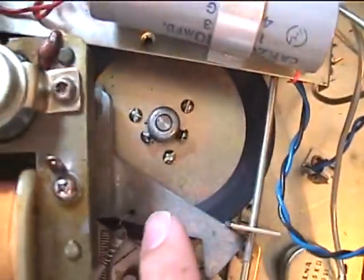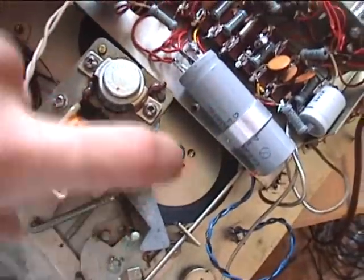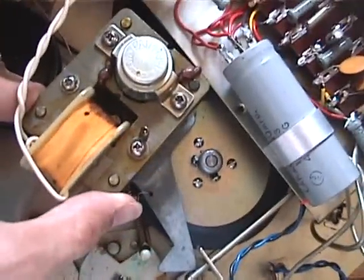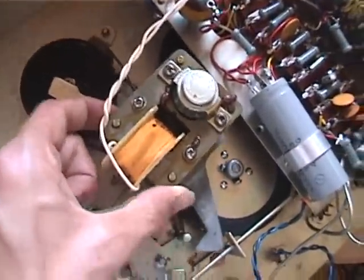Of course it's not turned on. If you notice, on the same motor assembly, the other side, there's a little part that goes out to a brake. So when you put it in play, it releases a brake. Whenever the motor goes down to push against the flywheel, at the same time it releases a brake. And then whenever it's put back to neutral, the brake is engaged again, and it moves the spindle off the flywheel. It's a rather simple design, yet effective.